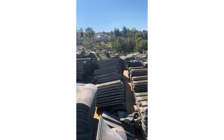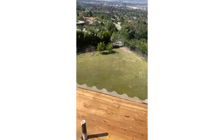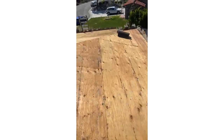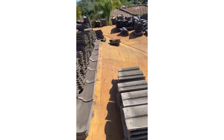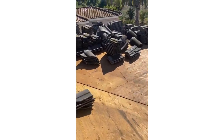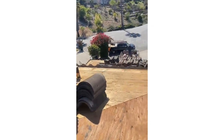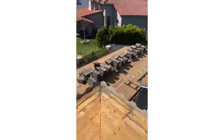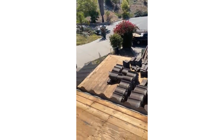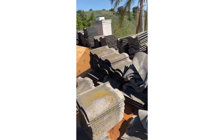When you're doing a tile relay or tile reset, replacing the old underlayment, remember it's a 50-year investment. Tell your roofer to replace all the damaged wood. Make sure you check all the damaged wood — you, the homeowner, are the inspector. Don't let the city inspector come in and approve a half-done job. Some roofers just fly through and leave a lot of damaged wood on the roof.